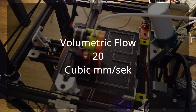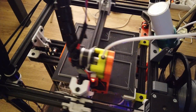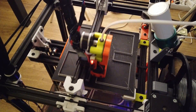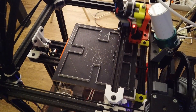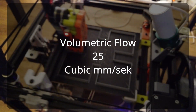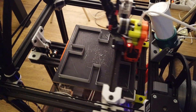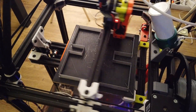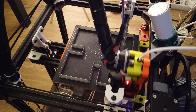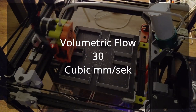200 microns layer height, 0.5 line width, 225°C on the hotend — this is the Dragon hotend, version one, standard flow. Let's go to 250, which means 25 cubic millimeters per second. Now at 275, that's 27.5 cubic millimeters per second. If you watched my previous video with this extruder in a Bowden setup, we only reached 20 cubic millimeters per second.